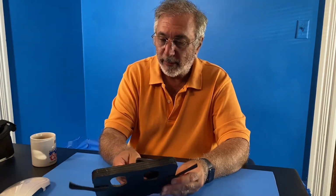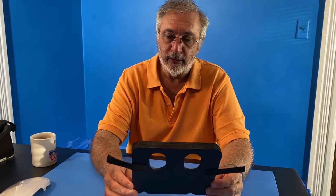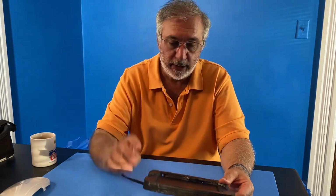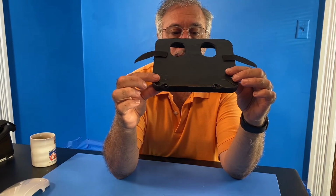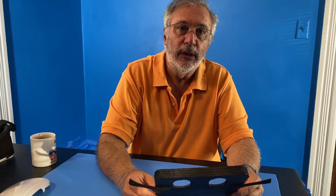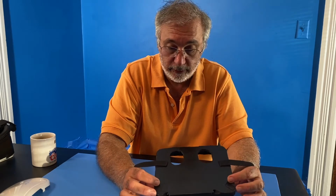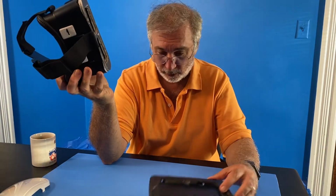So that's today's episode. And if you want to make one of these, it's pretty simple. You do need two identical camera smartphones to do it, and then some foam core, which is like 50 cents worth of foam core here, so it's not an expensive proposition if you already have a matched pair of phones. The other thing I did is I drilled holes through for the microphones so that they can pick up the sound from the front, and that could be edited together into stereo. It doesn't make any sense for tomorrow's video because there's no stereo sound information there, but that's basically how you do it. So I have a $5 headset, 50 cents worth of foam core, and I'm shooting 3D video.